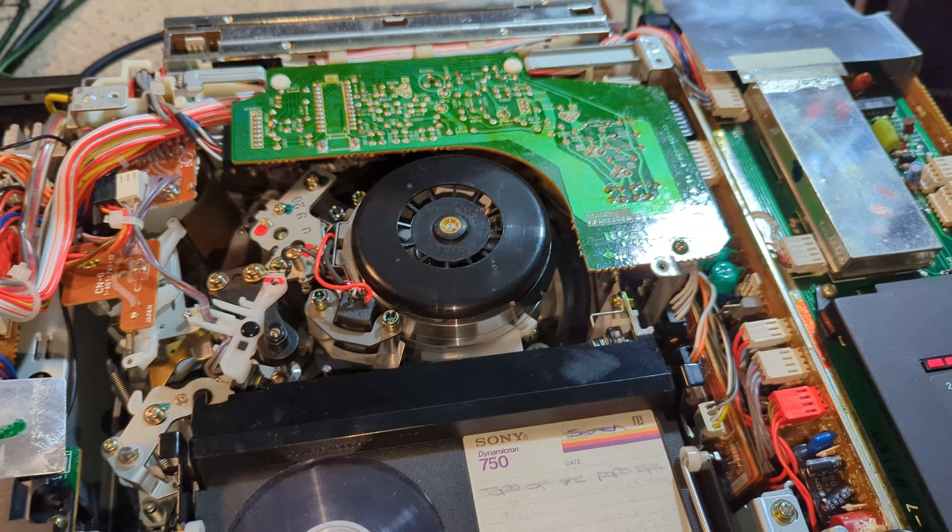Starting with the 0.47 - it's not great, not a good start. Reading 8.3 ohms - so that's that. This one is 1 microfarad 25 volts - it's just not reading great at all. Age obviously hasn't been kind to these. This is a 0.1.